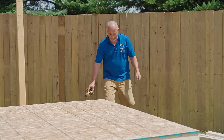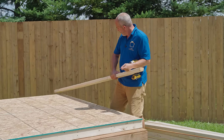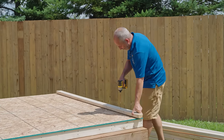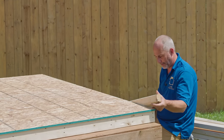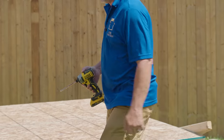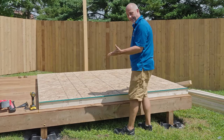We're going to set up a brace — make it nice and tight, back it up a couple of threads while pulling on it so now it's hinged. When you're working alone you'll be able to lift your own walls into place.